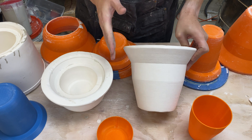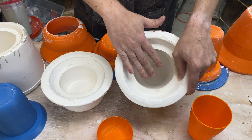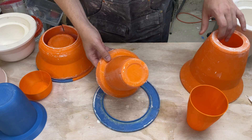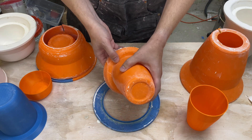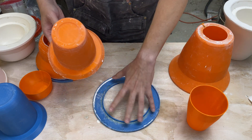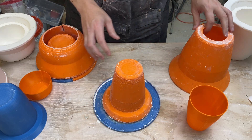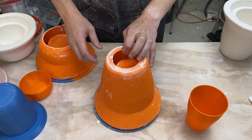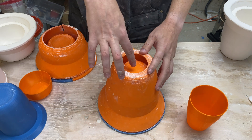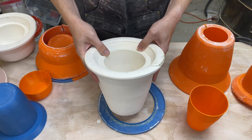The contour of the plaster more or less mimics the contour of the inner mold, and we did that by 3D printing this outer shell. So now we have a few pieces: the inner mold, which forms the shape of the pot; an outer mold to contain the plaster; and this ring to join them together. Basically this one got attached down there, the outer mold got attached, we poured in plaster, demolded everything, pulled off the outer, pulled out the inner, and that gave us this mold exactly.